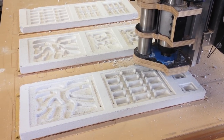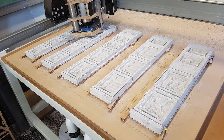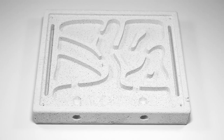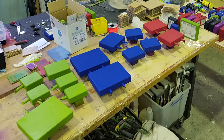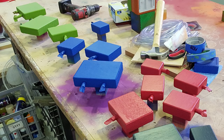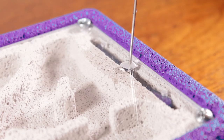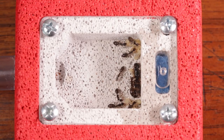Once prepared into composite slabs, we head over to the CNC machines. Here, the nest interior, hydration spaces, and rebates for the lid are precisely carved out. Once fully machined using our state-of-the-art equipment, the nests are then individually hand-finished and checked for defects. Although this does consume a fair bit of time per unit, we believe it's important to give each nest a practical and durable finish. After the final hand finishing, the sealing and painting happens. The nest receives two coats of durable, non-toxic paint based on recycled sugar cane. This specialised paint coating is done so that only 90% of the Ytong is sealed, so the nests can still breathe as they would naturally. Through extensive testing, this paint in conjunction with the plywood base and absorbed epoxy has achieved optimal evaporation rates, making it easy to regulate the humidity levels and emulate the natural nesting conditions of your ants.